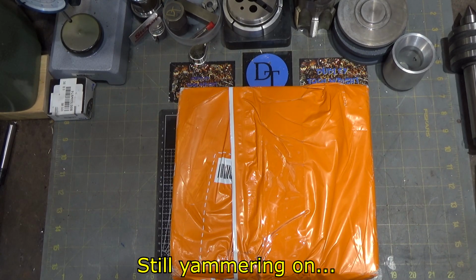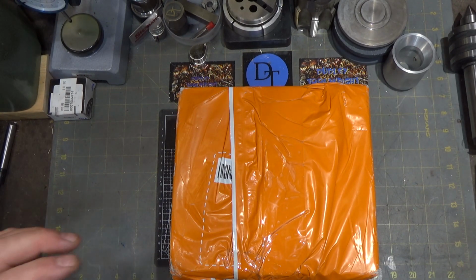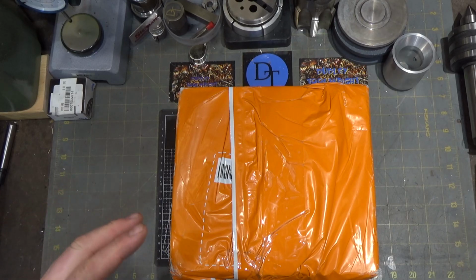So I took them up on it, because this one is not just a standard variable frequency drive. It also claims to be a vector variable frequency drive, which means it's going to try and maintain torque even at really low RPMs. Ordinarily, those are extremely expensive. The high-end ones have sensors on the motor itself that measure the magnetic field that the windings are generating to make sure that the current and magnetic fields are where they want.